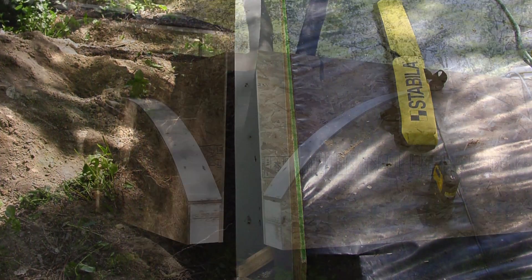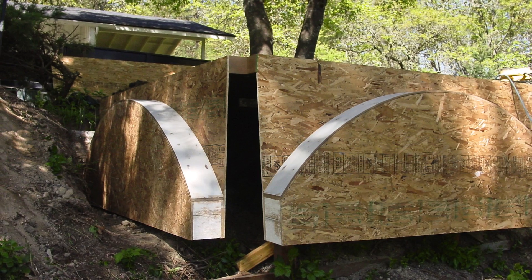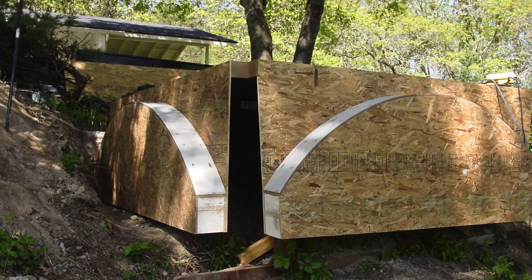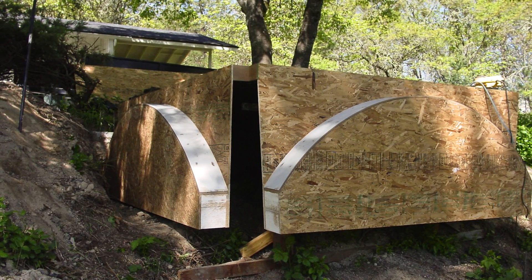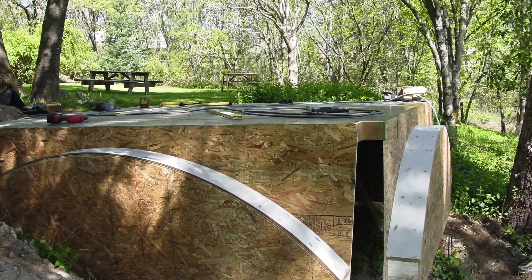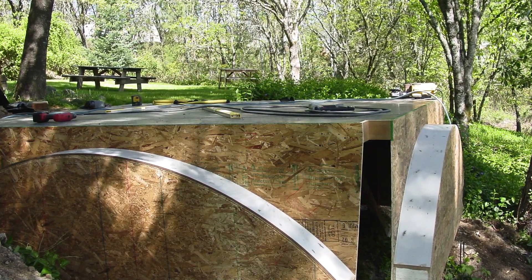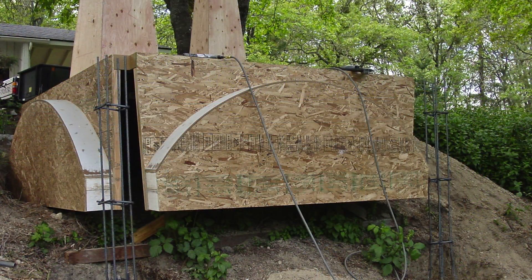It's important to note that there are blocks underneath those upper white curves. You can kind of see the nail holes there that are filled with silicone, so they're stout. The upper portion is just there to create a surface for the concrete to not stick to. It was really important to get all these dimensions correctly because the post form boards had to match up exactly to the curves and the deck, and make the curve of that under portion follow through to the inside of the post.